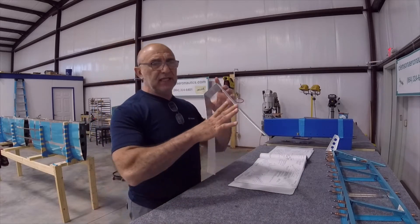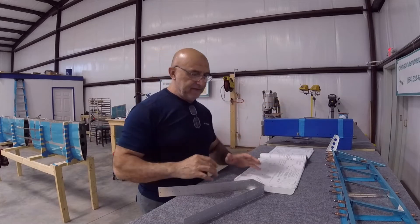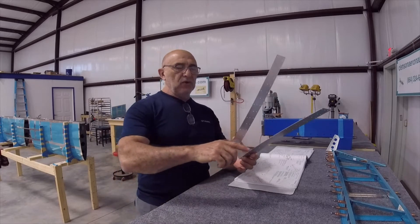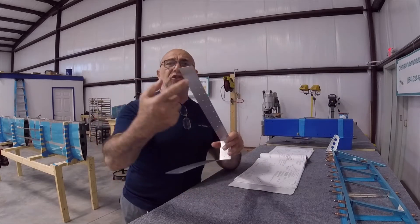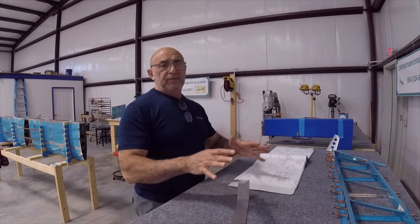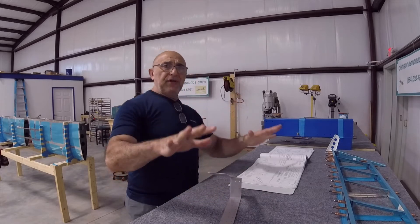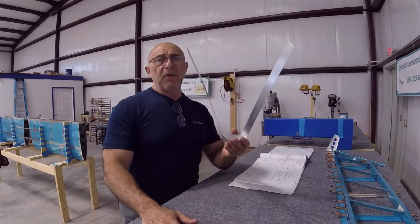I have the right elevator on the table on the right and the left one on the table on the left — I removed them and kept each side consistent. There are a few holes that you're not going to dimple. I started yesterday by deburring all the edges and holes on both, then scuffed them and returned them to the table. Now I'm going to set up my squeezer to dimple the holes on both, then go ahead and prime the ones on the right first.